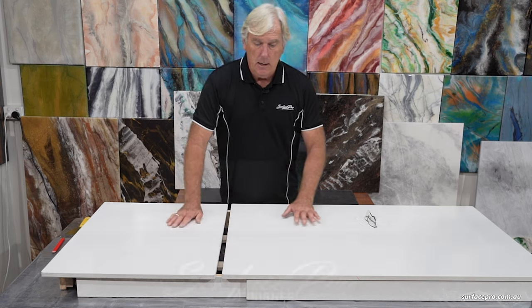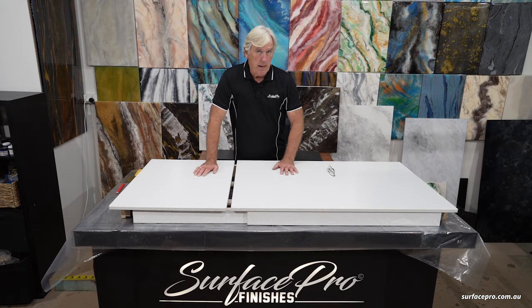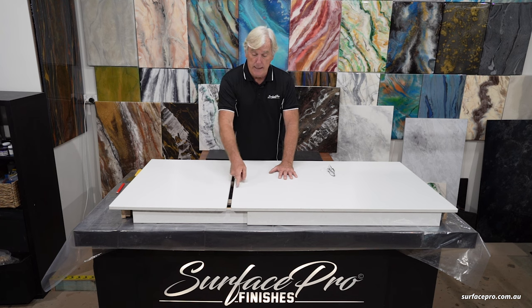Now, look, you may have something similar. You may have a table which has a little bit of water damage. They can be fixed. And this is what I'm going to do with this one. If it has some sort of laminex or melamine or formica top, it can be fixed. If there's a little bit of damage, a little bit of rot, particle board is swelling, it can be cut away and it can be filled. And that's what I intend to do here.